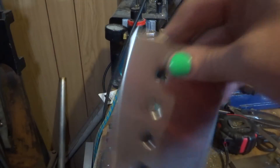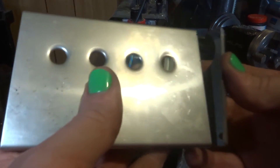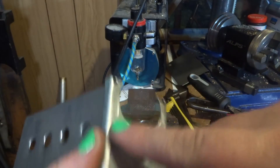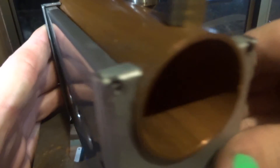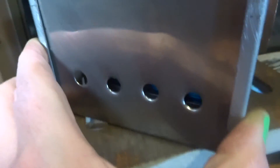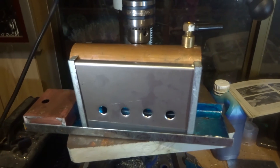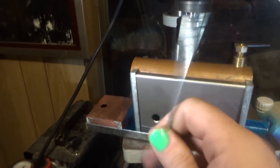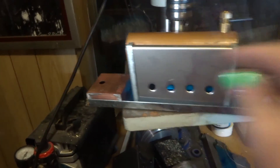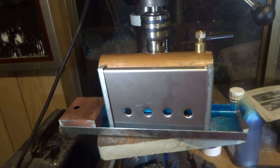Making them up was pretty straightforward and easy. That's what they look like — they might need a little bit of fine tuning, but they fit together in there like that, where the bolt goes through this hole and this hole and holds it all together. So that's another bit made. That's all just sitting together there on the base with the burner — starting to look really quite businesslike. Next job is to make some bolts to go through it. I've just got some soft 3mm steel — probably brass, welding wire, or anything could do — just to run through there with a thread on each end and four nuts. And that's the firebox finished. Thanks for watching guys, and now we're on a bit of a roll — more pretty soon.